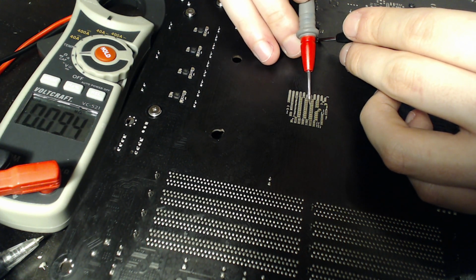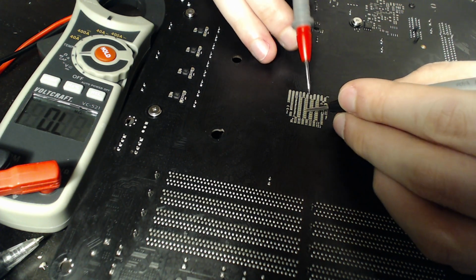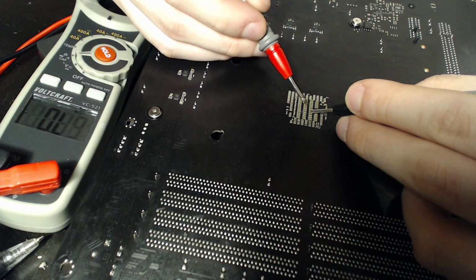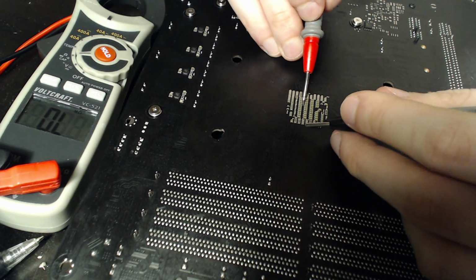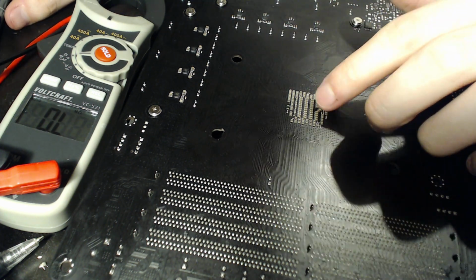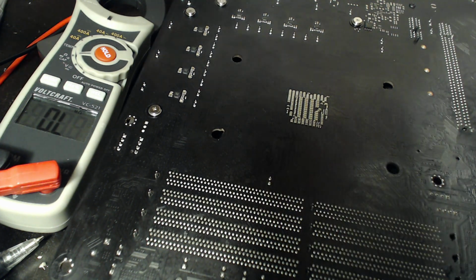We're going to solder sort of in the middle of the Vcore. There's basically this row. From here to here, we have Vcore capacitors. And here to here, we have Vcore capacitors as well. They both have Vcore on the same side, so we're just going to solder right in the middle of them so that we can't accidentally hit something else. So, we've now chosen our target for soldering. Now we need to actually get around to the equipment.